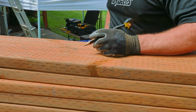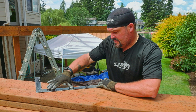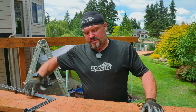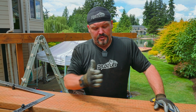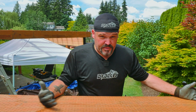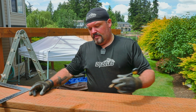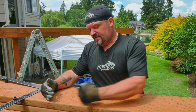6. All right. Again, it's still not quite there, so I'm just gonna tweak this just a tidge. Okay. Now, a couple more things. I'm also gonna add a piece of 2x8 or 2x6 or whatever 2x material to the nose of each tread. A lot of people don't do that, but I do. It's just the way I roll. So I don't have to take any material off of this jack because I'm gonna add material here and I'm gonna add material here and it's gonna give me the same distance.